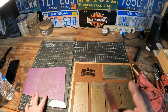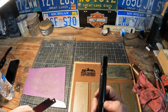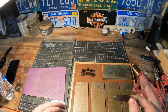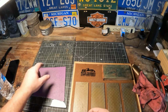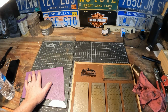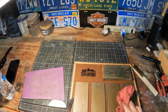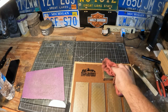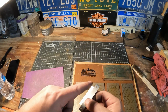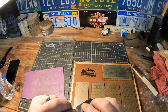The marker test came off clean and it was great, but I think it was just oils on it and this wasn't dry enough or something, because I'm doing scratch patterns and I could see low spots and low spots. I had to bust out 150 grit on a piece of glass just to get it somewhat close, and then spent the next hour working through all these stones, the diamond plates, to get it flat. It is unreal.